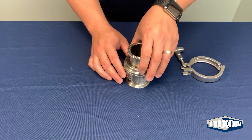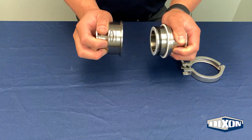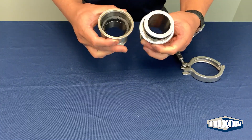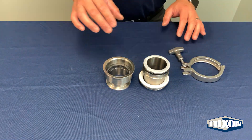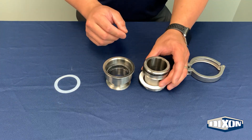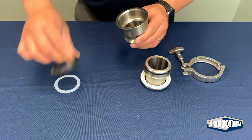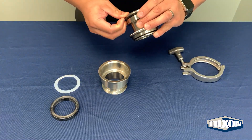Slide the upper body and the upper body seat away from the swivel. Pull the inner body straight out — be careful not to angle it. The upper body seat, inner body gasket, lower body washer, and upper body washer can now be removed gently to avoid damaging the seals or bodies.